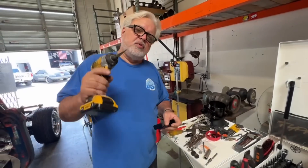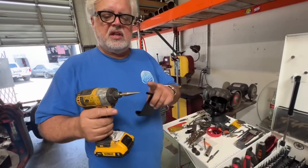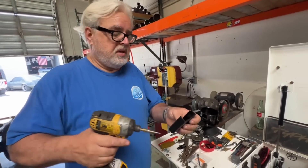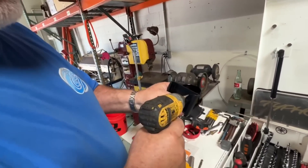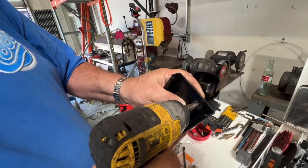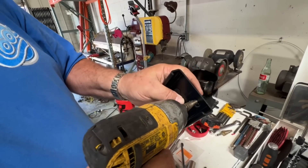Just above the little felt — to stop it from vibrating — I use a unibit. Why do I use a unibit? When you've drilled holes with unibits, if it's thick, you notice that it drills the right size hole and then deburrs it, chamfers it a little bit. That's exactly what I'm going to be doing here. So I'm going to drill a hole here — you only get one shot to do this.